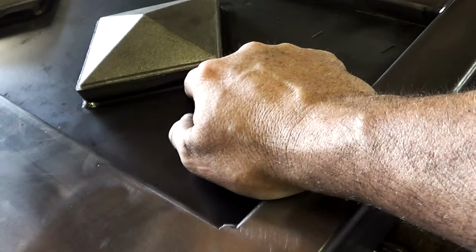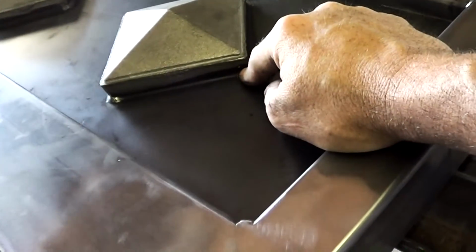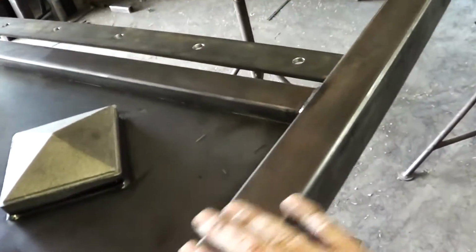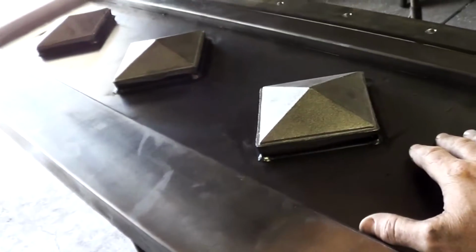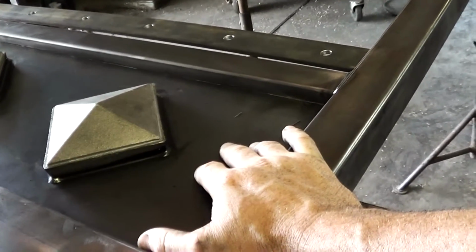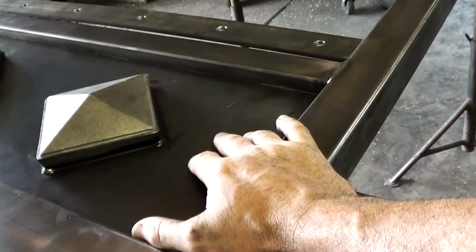So anyway, to move on, this is the gate we're going to paint today. It's the one that's replacing the one we already built. It's a little bit special, a little bit unique. I've already filled these with some painter's caulk, just to keep water and stuff from getting trapped behind these. But first things first, this thing needs cleaned. I'm going to give it a light sanding, wipe it all down, then flip it over and do the other side, and then we'll put on the first coat. Let's get started with that.